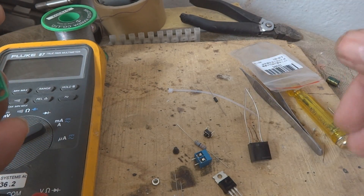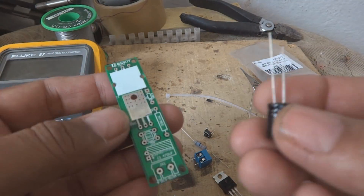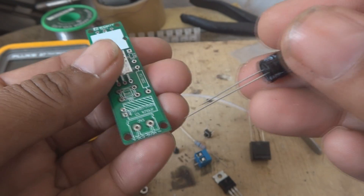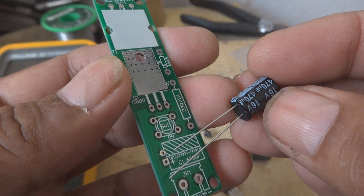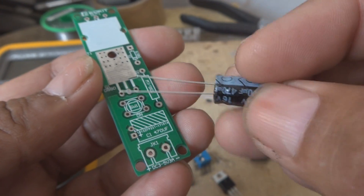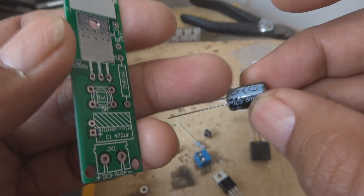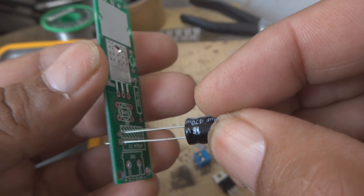So these are the components they have sent. And of course there is a tie to tie up this transformer. Here is the capacitor which is for smoothing — it will be over here. So this is the 470 microfarad, 16 volt capacitor as you can see. We will put it in the way that the positive will come over here. This long lead is positive. And this arrow you can see is also denoting the negative. The negative lead is shorter of course.